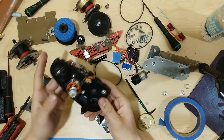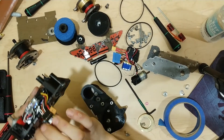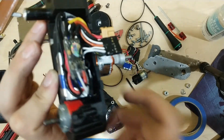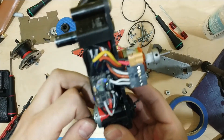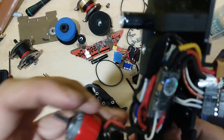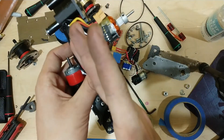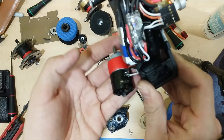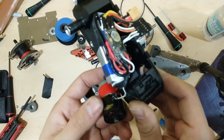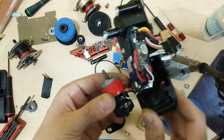I actually can't take these electronics out very easily because I glued the master switch in right before the competition. I can break that glue and unbolt this motor to get it out, but I'm not too worried about that. My ground wire for signal on this motor got ripped off — this is the one that got shoved in by Titanium. I was very surprised my signal wires didn't break and that the motor was still running after that. The cutout I have in there to allow wires to be installed may have saved me. But it still sheared off the signal ground — luckily the regular ground will also act as the signal ground. It's just a little bit of a noisier signal, but clearly there's some redundancy in there. A little bit of soldering to get done.